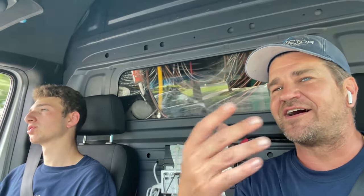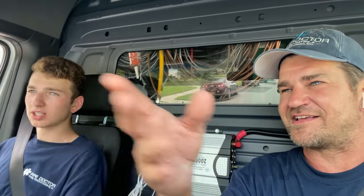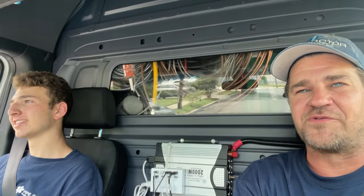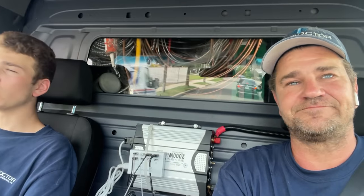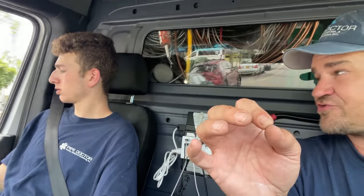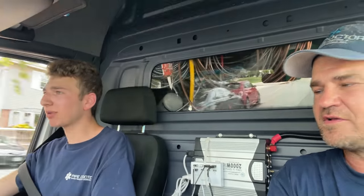Normally they would have told us by now - she would have said 'Inside Edition' or whatever. But there are contractors out there that will literally rip people off - 'your compressor is shot, the capacitor is no good.' It was very visible as soon as we took that cover off. I thought the wire was going to be hidden somewhere, just fallen off - that happens, things get loosened up. But that wasn't the case. The wire was cut off the spade connector on the contactor. Someone had to go inside there with a quarter inch driver.